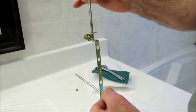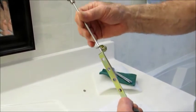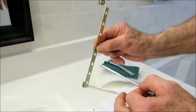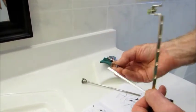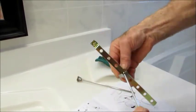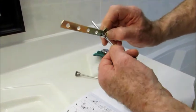This part goes through here like this; this part comes down from up above in the faucet, and you attach it — you tighten this little nut on here to control how much of this is up above the faucet. Now, in order to hold this rod in this bar, you need this little spring here. Can you see that? One side goes on one side of the bar, the control rod goes through like that, and there's a spring action here.